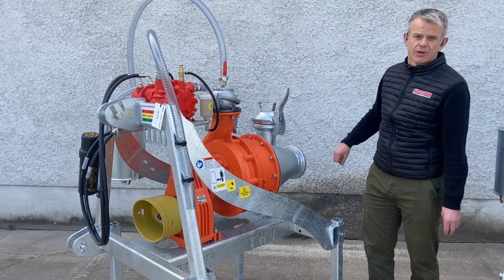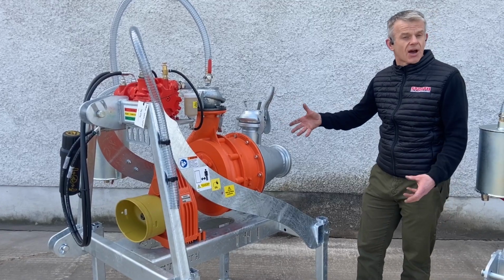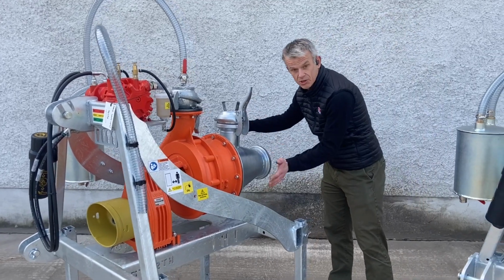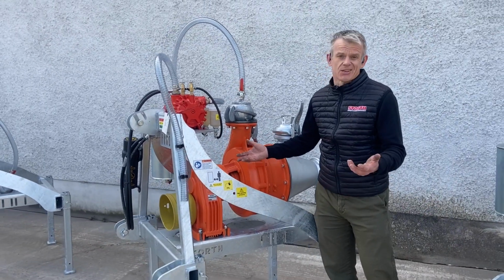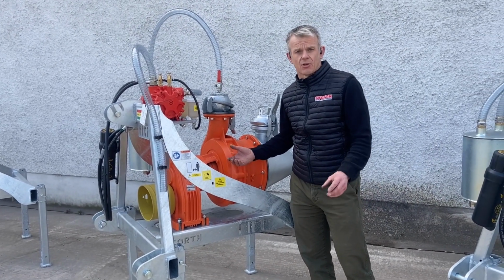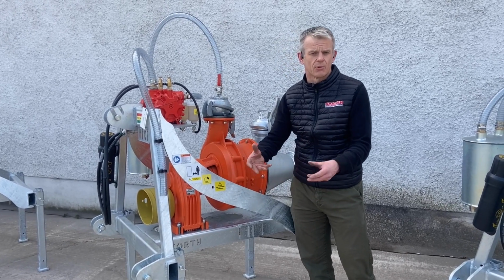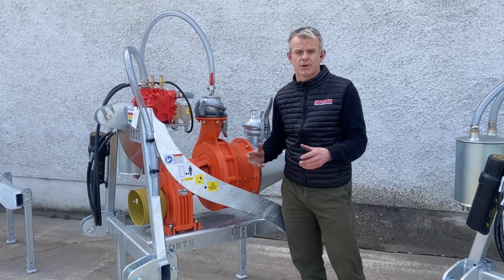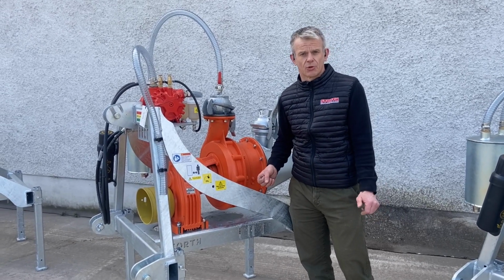And we've got on this one a Doda L35. You can tell this is an L35 and an L35 HD because you've basically got a cooling jacket on the HD. Okay, we're selling the HD as a 1 to 2.73 or the 1 to 3.31, depending on how big a tractor you've got and what pipework you're sending it to field down. So pretty much we've got every eventuality of pump that you want to look at.